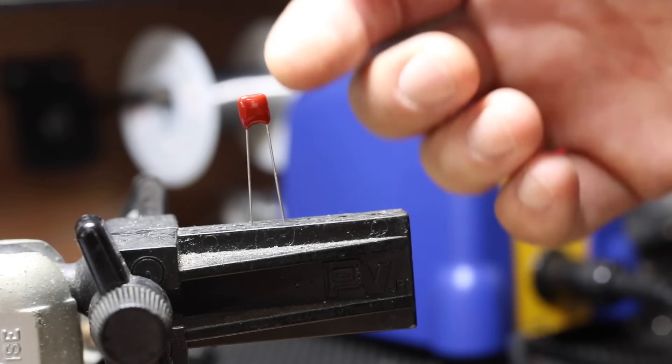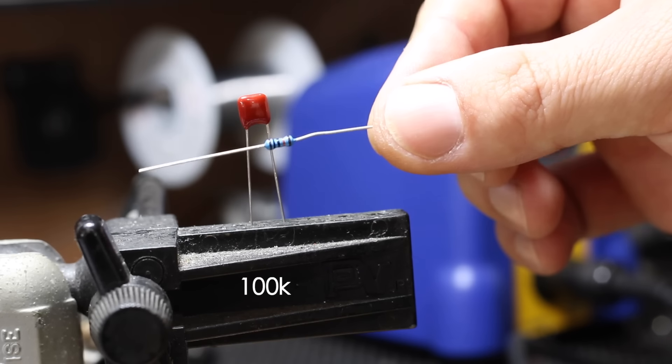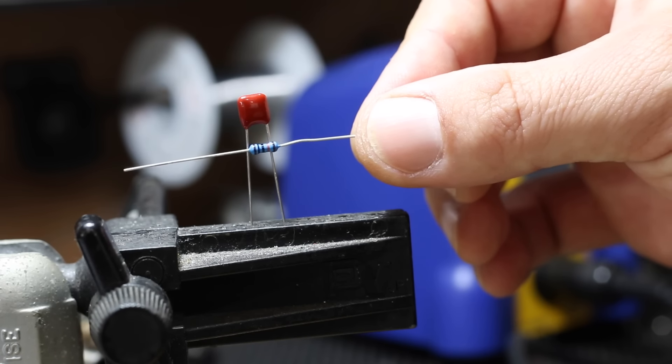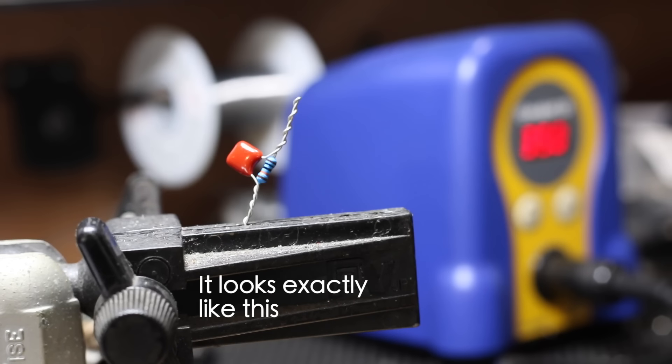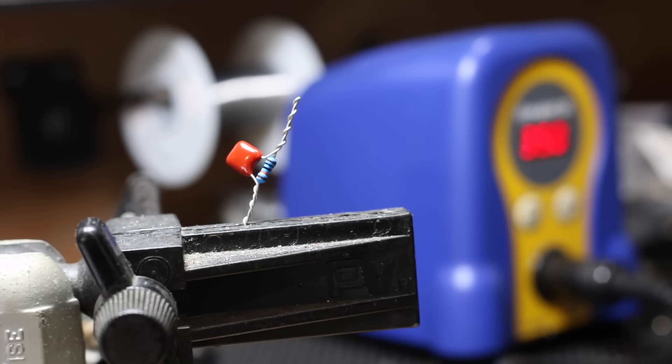What I've got here is a 10 nanofarad capacitor. I tend to stick with one capacitor value and vary the resistor, so I'll grab a 100k resistor and just twist it between the two legs so they're in parallel. You could replace this resistor with a variable resistor and wire it to a pot for absolute tweakable control. But I really want to focus on a simple upgrade — just one cap and one resistor — and then you can experiment from there.